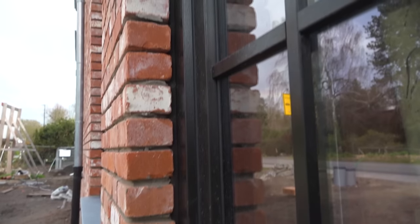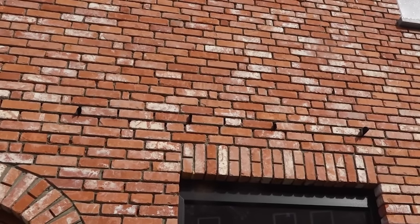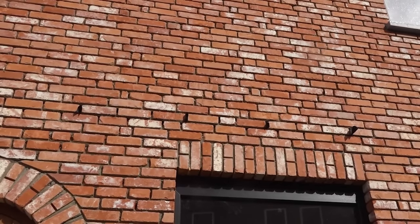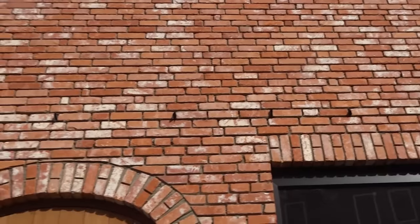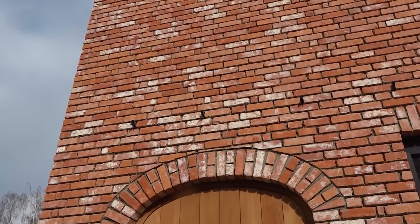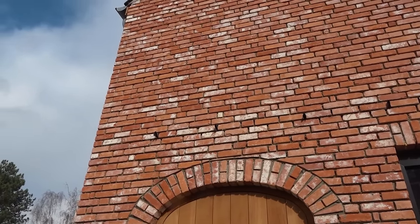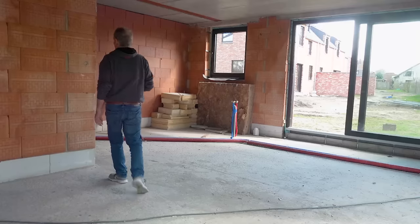Here's the detail around the windows — they're going to put some backing rod in there and then go around and caulk the lot, but you can see the builder keeps away from that. Here are a few more weep vents. That's a cavity tray over the top of the openings — the door and the window. There's a nice cavity tray there and they'll obviously be putting some weep vents in at some time in the future, once the scaffolding is taken away.